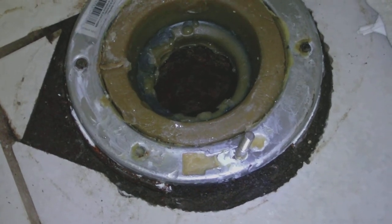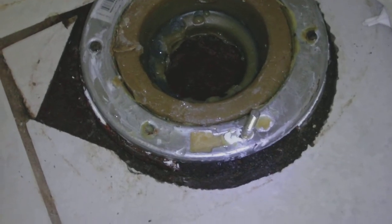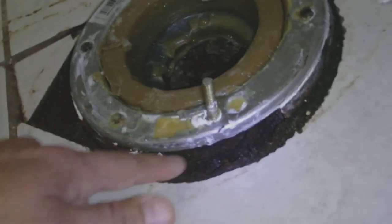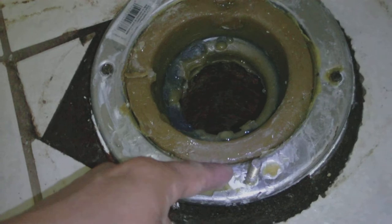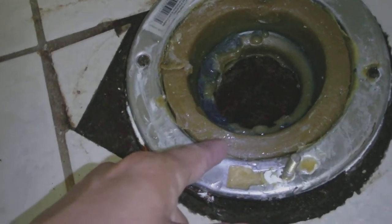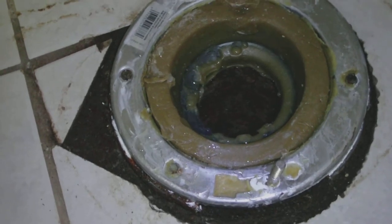I had a jumbo ring on this before, and before that when we first purchased the home I think the previous owners smashed two jumbo rings together — it was just covered everywhere. This adapter I actually added because the flange down there was completely rusted and rotted with no place to hold the anchor bolts. You can see there's water shooting out the side right here, so I'm going to add a new jumbo wax ring. This standard ring unfortunately didn't do anything — I had water shooting out on this side as well, so it wasn't any help for my situation.